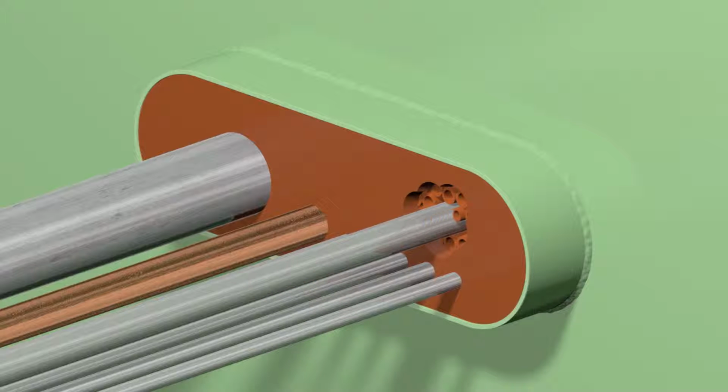Add extra single sleeves to fill any open spaces. Clean and dry the newly ducted pipe thoroughly and refill the opening in the sealant layer at both sides of the transit with NOFIRNO sealant. Finish the new sealant layer in the same way as done for the initial sealant layer.